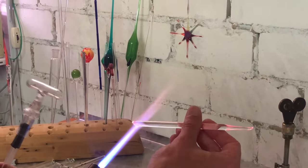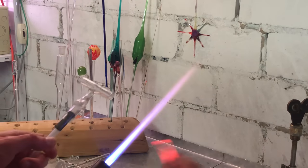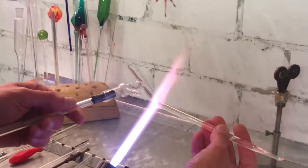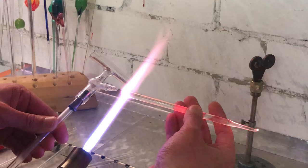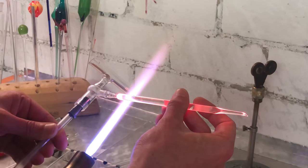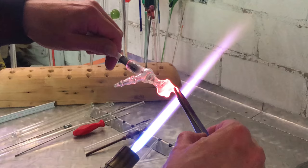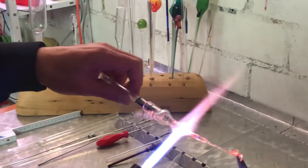In order to attach the valve, the side opening must first be closed. In this case, no rubber stopper can be used, because it is too close to the flame and would melt. Therefore, Johann closes the side neck with a glass bead. It is important that he only heats the glass bead and not the opening - this allows him to create what is called a cold seal, which can be knocked off very easily later. If both pieces are heated, the glass will fuse permanently. With the side neck closed, the tap can be prepared to be mounted next to the NS14 glass ground joint.